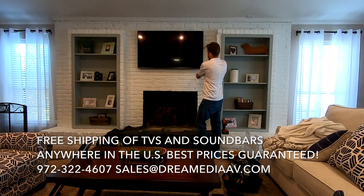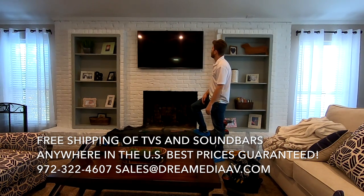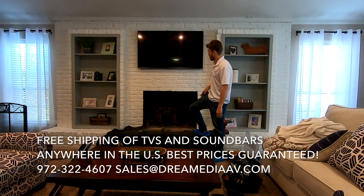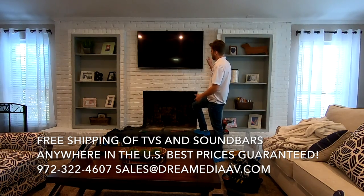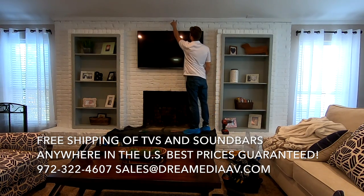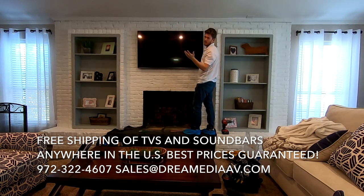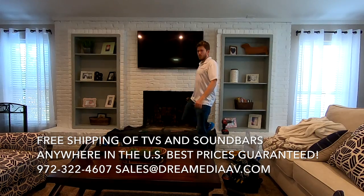The next thing that we're going to do is mount the soundbar and flush mount that right underneath the TV. Now, if you're wondering what we're going to do about wire concealment in this particular situation — this is a true wood burning fireplace, meaning there's no dead space behind here. So you can't run the wiring up and around or out the backside because it would ruin the integrity of the fireplace. What we talked to the customer about doing is hiring a mason to either remove the mortar and shoot it up in here, or just do a little channel to shoot it into the trim. We're going to rip the trim off — or the handyman is — and put the wiring inside of the trim so that you don't see it. We'll go ahead and get the soundbar up on the wall.